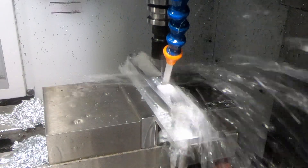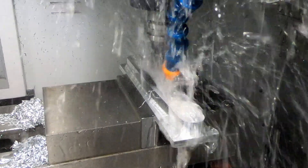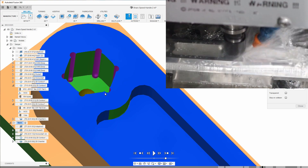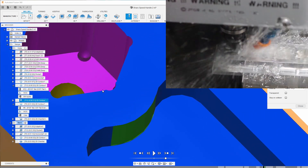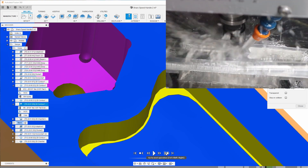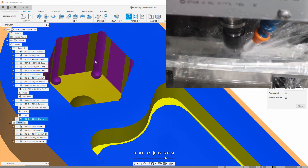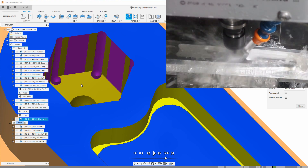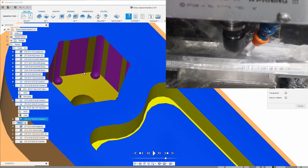It's a delight to watch the one-sixteenth inch drill just go through the material. It's also amazing to see just how fast this machine is. The roughing operation left some cusps, so when I finish it with the three-sixteenth inch end mill, you can see it mostly gets rid of the cusps, but not completely. So then I have another pass that uses a one-eighth inch end mill, and that completely gets rid of the cusps. But you can see that because it's using rest machining, it's just machining a few small areas, and I didn't set it up correctly so it's retracting and then going back down for each of those sections.